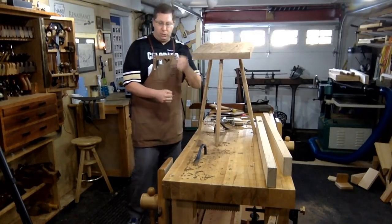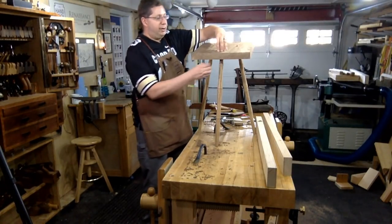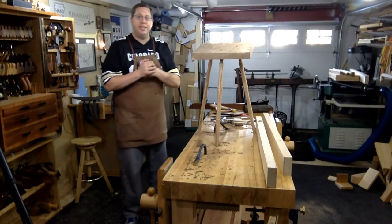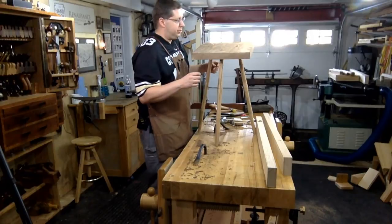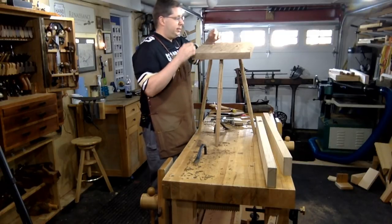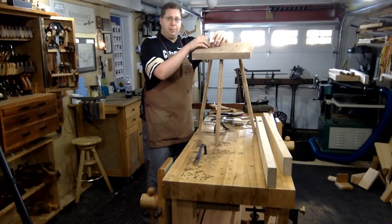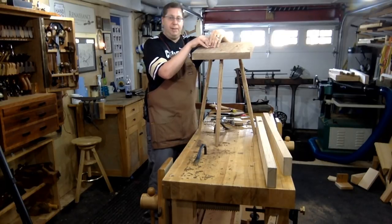So once you pull them out of a kiln or like a little box with a light bulb in it, the legs are going to start swelling. So I want to orient them in such a manner that they're going to swell at the same time the seat is going to be taking on moisture from the leg, and it's going to swell. And I want them to swell in the same direction so you get a nice locking setup. So what I've done, not only, it's so hard to look from this direction, but what I've done is oriented in such a way so that the radial plane, in other words, the smallest amount of expansion, is in line with the grain of the seat. So the greatest amount of expansion is going to come across the grain as the grain shrinks around it at the same time as there's water going into that.